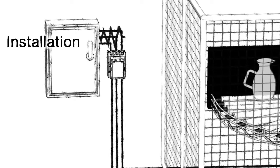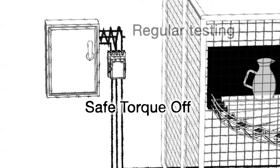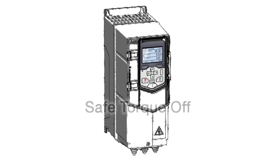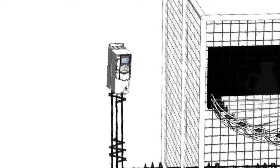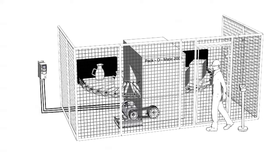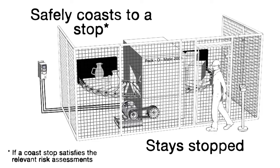It's another piece of equipment that needs to be installed, maintained and regularly tested, and they're not as safe as the modern alternative, Safe Torque Off. Safe Torque Off brings the stopping functions of the contactor into the drive electronically. Now when something triggers the sensors, the drive itself shuts off the power to the motor instantly, allowing it to stop safely and stay stopped until an operator instructs the drive to start the process again.